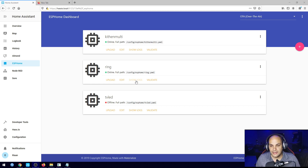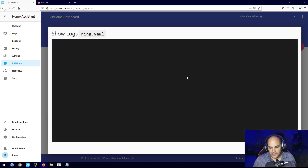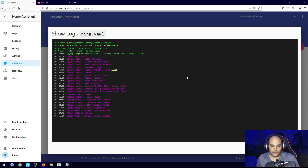That code uploaded. Let me start the logs. I'm going to press the doorbell button now — and as you can see it sent the state 'off' and then it sends the state back to 'on'. That's all we need: add that to Home Assistant as an input and set up automations based on those states. As soon as the state changes from off to on, we can trigger an automation.